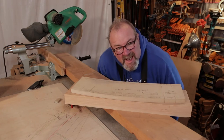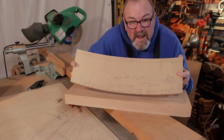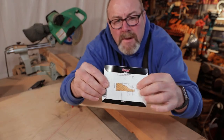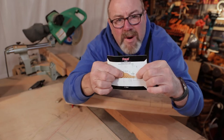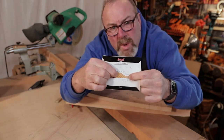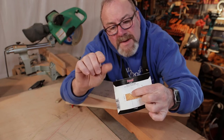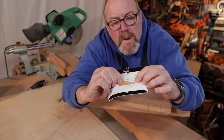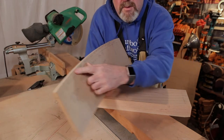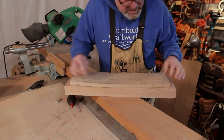We're laying out the curved parts and we made a little jig out of MDF — a front part and a back part. This jig is for the raised panel molding. The raised panel part is in the middle of the square — it sticks up like a raised panel. Since it's curved, we have to make this part here. That little part right there is what I'm calling the raised panel molding — this part is going to be separate. I'm going to make a little panel that's curved, three quarters of an inch thick. This material is five eighths of an inch by an inch and three eighths. This is the curve of the front of the door and this is the curve for the back of the door. This is like a tracing jig, and we can also use it as a flush trim jig later on. We set it on here and trace it out.